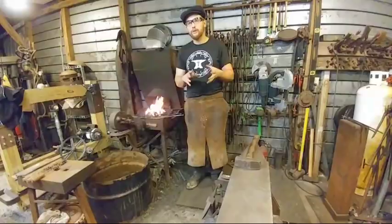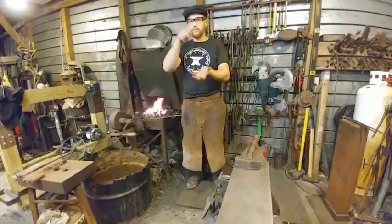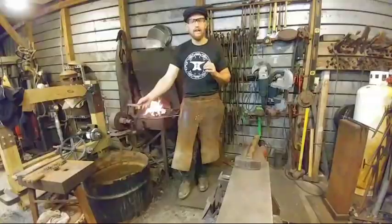So the Hardy hammer I built to be a portable hammer that can attach to an anvil surface. And it was really designed to work with tooling, so working with top tools, things like that, and kind of replace the need for a step hammer, so to speak. Working with the tooling bracket on the revisited design of it, it can draw out material very effectively, but it was meant to be a lightweight portable hammer, so therefore it only has a 12-pound ram.